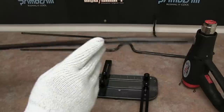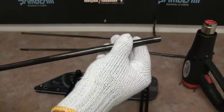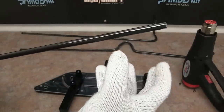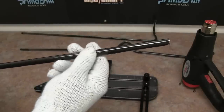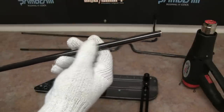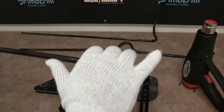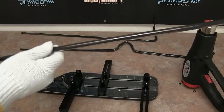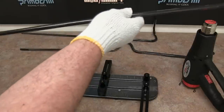We've also noticed with the PETG there's a lot less kinking in the corners — the material is a lot more forgiving when you heat it up and it cools back down and solidifies. We noticed that with acrylic it does leave a little bit of kinking, so with acrylic it's really important to get it to a good temperature and do your bend immediately. With PETG you have a little bit more working time.